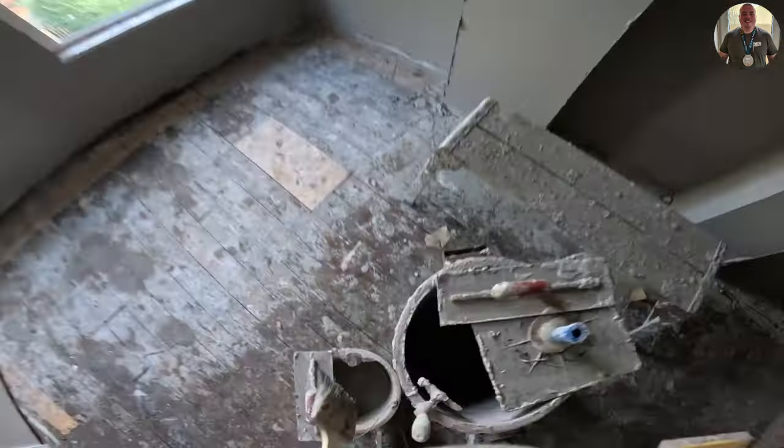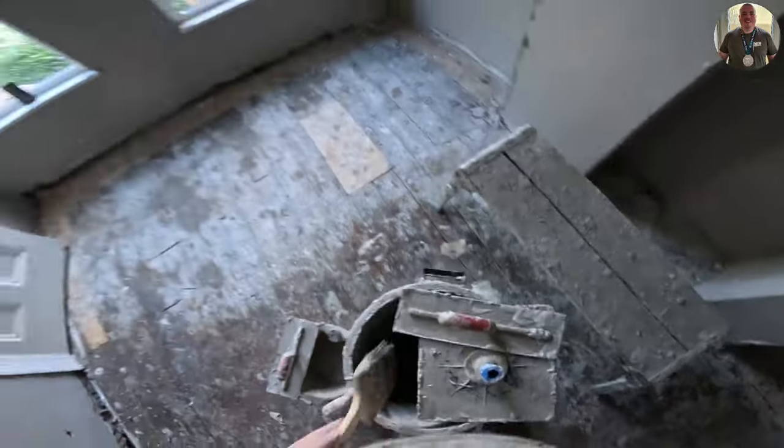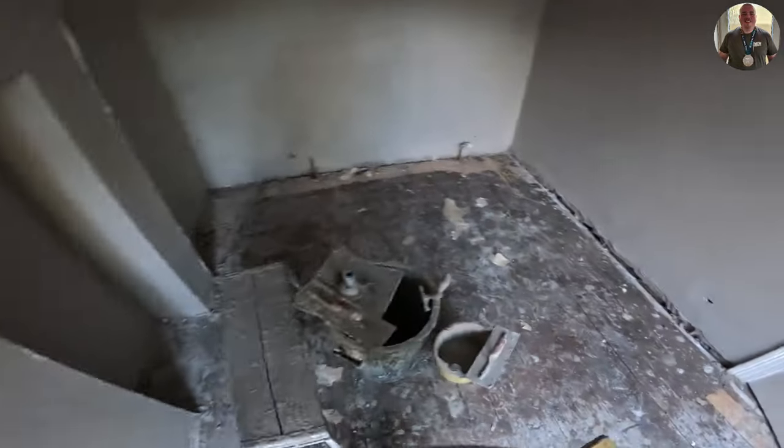Basically, what I do with a water brush when I rub the brush on the surface is the same thing you're doing with a sponge float. You're agitating the surface. So it's basically the same process that I'm doing, only I'm using a sponge instead. And the only thing that I would say is the sponge actually does agitate the surface more than the brush. I found it makes a lot of fat.